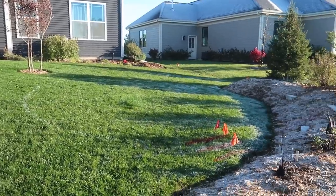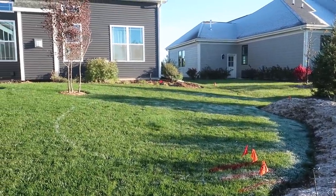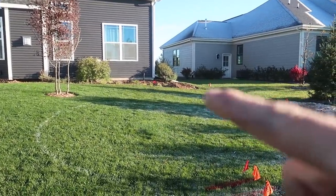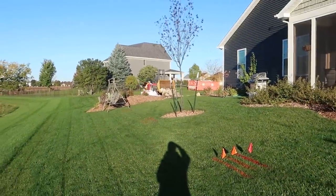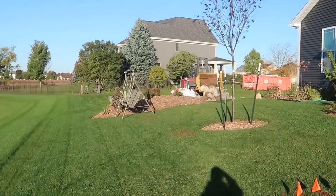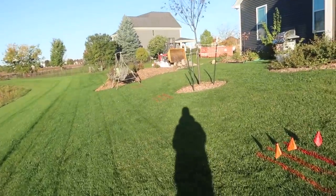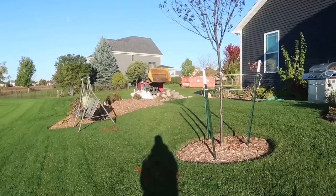The reason for the negative edge and the pondless reservoir is that it will act as our skimmer — the negative edge sets the height of the water level in the pond and maintains the skimming action. You can hear Illinois Brick behind me, as always on time and reliable, delivering our stone. We've got about 15 tons of boulders for this project. It's going to be a granite feature with some ledge stone steps.